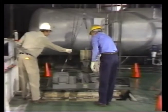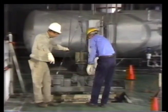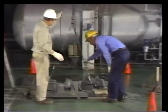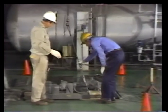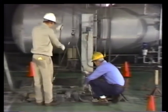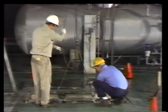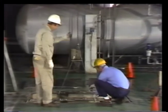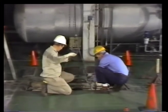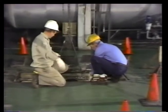As the load gets close to its position, it's adjusted so it can be lowered right down the center of the opening. Norris signals the crane to lower the load, but when it comes abreast of floor level, he tells the crane to stop and slowly lowers the unit through the opening with the chain hoist. Once the load is safely through the opening, the crane can continue the lowering operation. The men on the floor below signal Norris, and he in turn relays the signals to the crane operator. When the load's set down again, it'll be in its new location, ready to be installed.